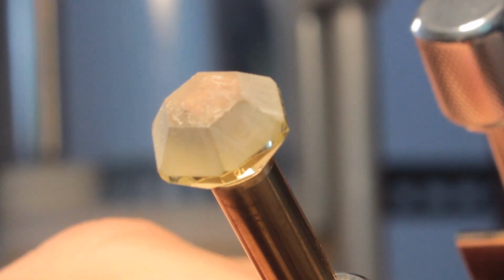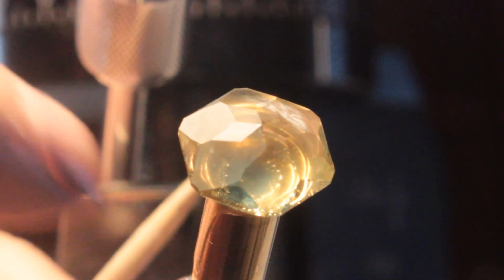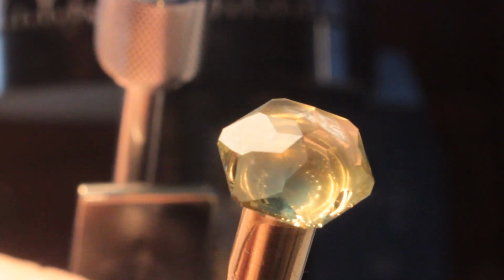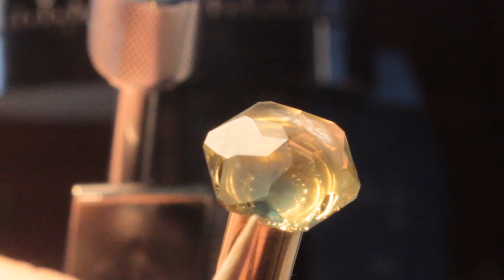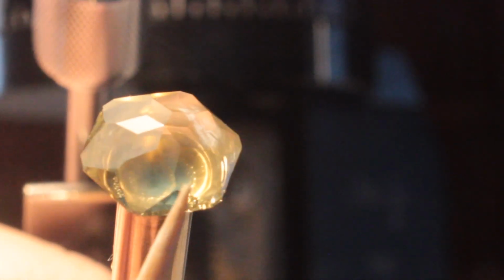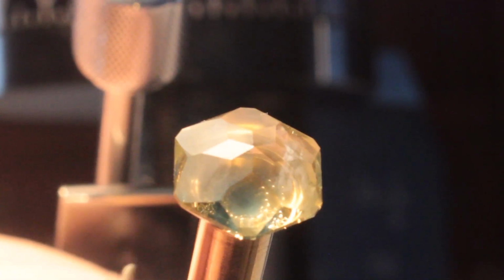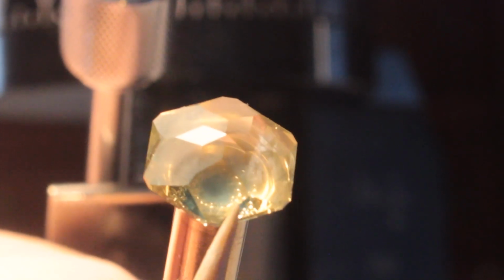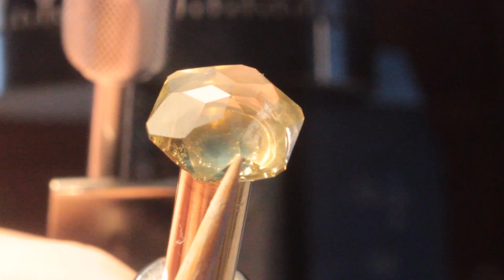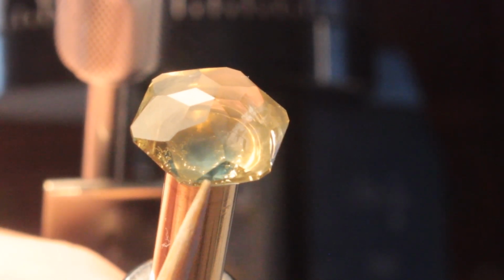So now I'll go over it with my 600 grit solid steel lap from Crystallite. Okay, we've got the C1 facets that go along here. They're polished now with cerium oxide and a tin lap. And now I'm going to polish the C2 facets, which are right here. Now the C3 facets, pretty much not quite. I didn't pre-polish those in with the 3000 grit.